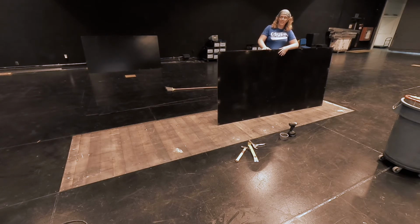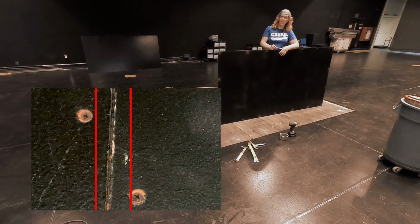One of the guidelines for spacing your Masonite is you always put them down with the thickness in between the Masonite a dime's width apart, the thickness of a dime. So if you want to have a couple of dimes and place them out, you could do that. That solves a couple of issues long term.